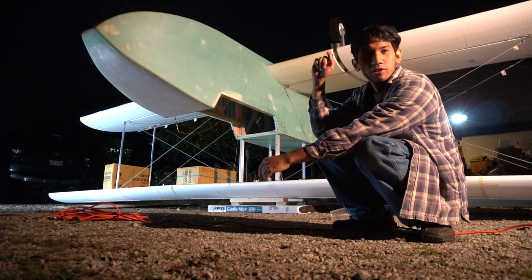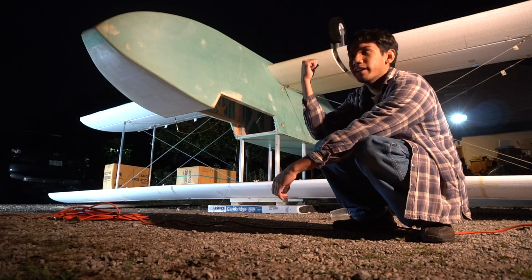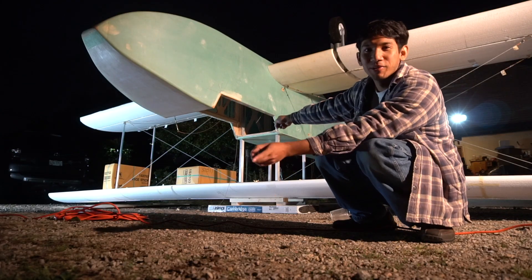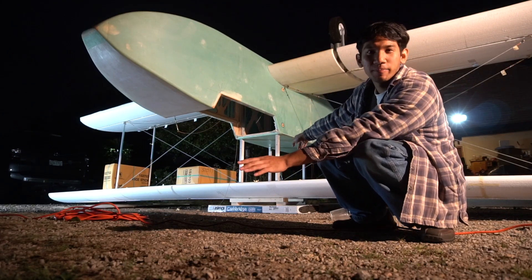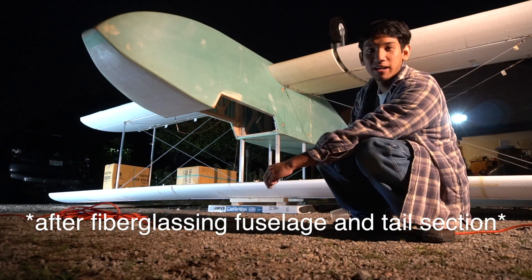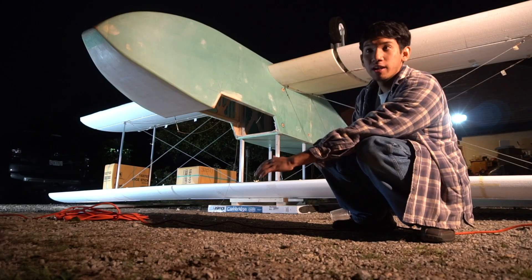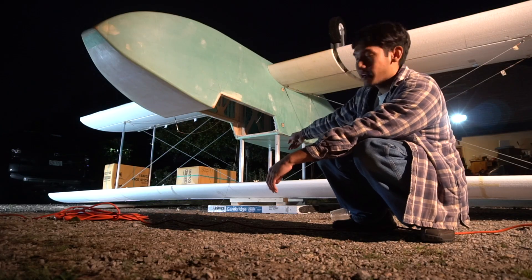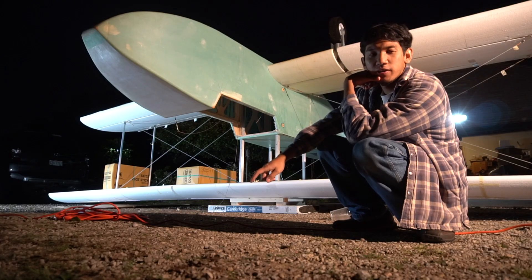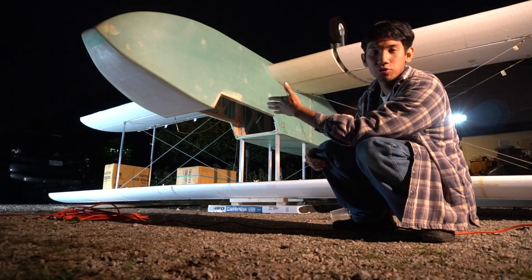So now we're going to go up to 2.5G. The all-up weight of this airplane is, with me in it, 370 pounds is what it should be. By the way, I did weigh this fuselage. Some people said, oh, that thing's got to be 500, 600 pounds — are you guys crazy? Even before I fiberglass this thing, this whole thing only weighs about 170 pounds on the scale. Glassing that 3/4 ounce cloth on the wing should only add, at the most, 10 pounds. So for 2Gs, I need 370 pounds. We're going to put 370 pounds worth of these boxes on it — that takes us to 2Gs.